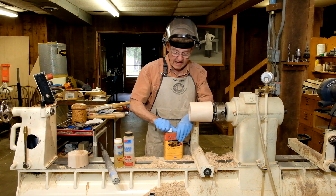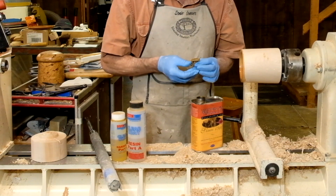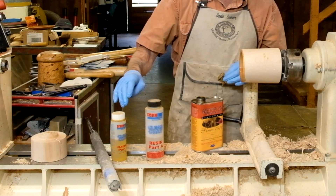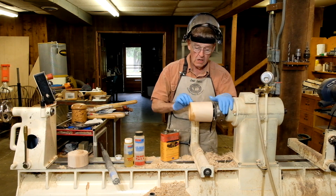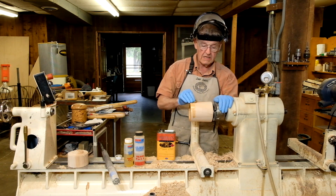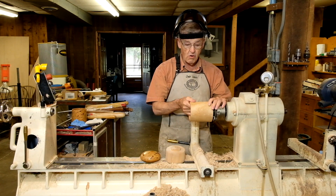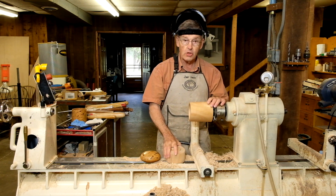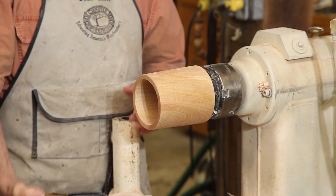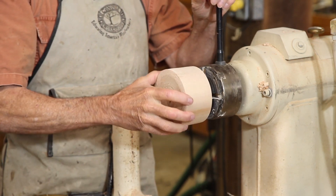It's nice inside, nice outside. Might as well put the first coat of finish on while I'm here, and it can be drying while I'm working on the lid. Another great finish for canisters is System 3 clear coat, which is an A and B epoxy type finish — it's food safe and dries very hard. A good oil finish such as Waterlox is also food safe if it has gassed off for 30 days; you really have to wait 30 days for all the volatiles to come out of it to be food safe. Our coat of finish has dried overnight and is well on its way to being cured, so it's now time to make the lid, which we'll make from the piece that we cut from the canister itself. To do that we will unchuck the canister, chuck up the lid, and turn a tenon on the end of it which is a press fit with the inside of the canister.